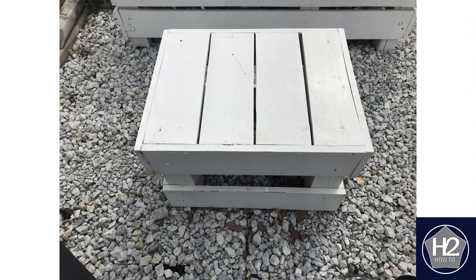Now this table was a quick build. As you can see, there are screws located throughout this particular build — I was just done because this needed to be done quick. I did not want to go the route of trying to hide the screws. Here we can see the lag screws that were used; the lag screw is used to attach this board to the 4x4. That second board is then used at the bottom, flush with the bottom of the 4x4 post, and this section received the two-inch exterior screws. That was pretty much the process.